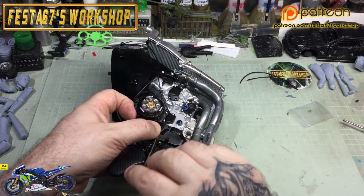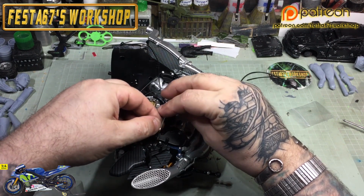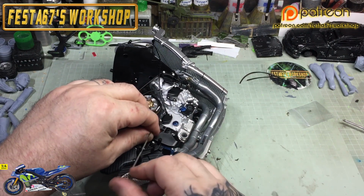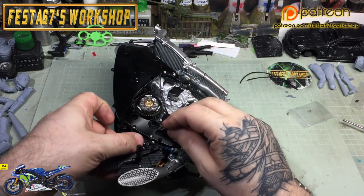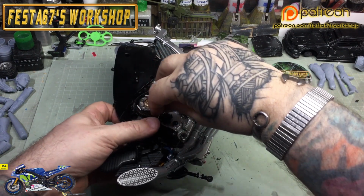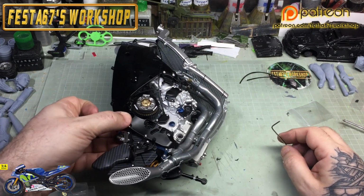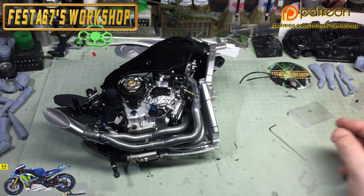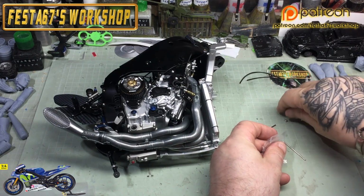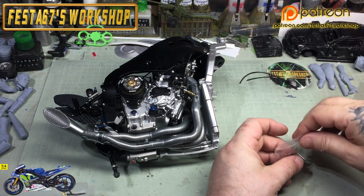Obviously, I don't want to go too mad and snap the head off, because then I'll be crying and flailing around on the floor like a five-year-old girl, which we don't want, but we just want to nip that up. And you'll find the same when you do yours, folks, unless you run a tap through there to clean the paint out, you are going to have to get a bit aggressive with her in a few spots, but, hey, no pain, no gain, innit? So we'll just pack these bits and bobs away, because that stage is now finitoed.